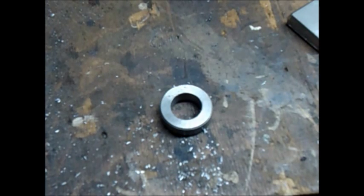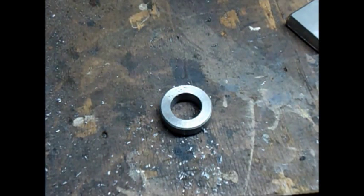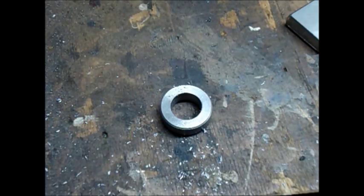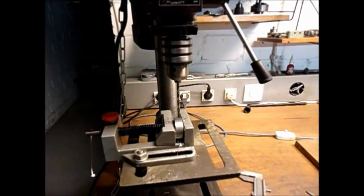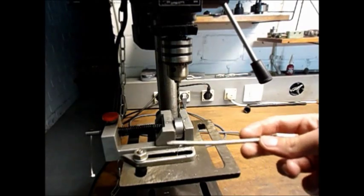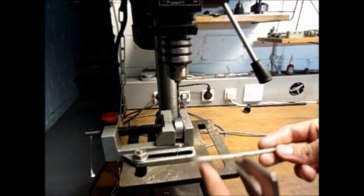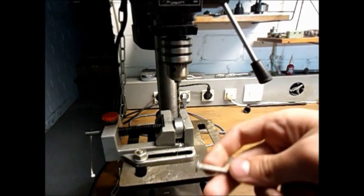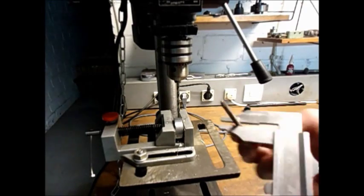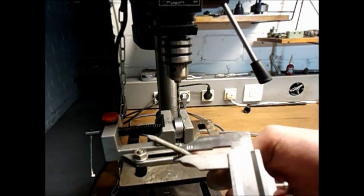The turning part is finished. The next thing will be drilling the two holes: one for the thread for the mounting screw, and the other hole for the carrier. For the carrier we are going to use this old nail — I'm just going to saw or grind off the tip and the head, and bend it to shape. It has a 4.5mm diameter.